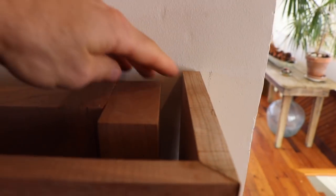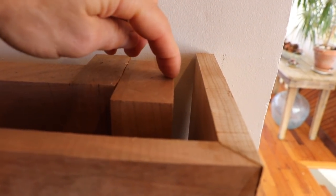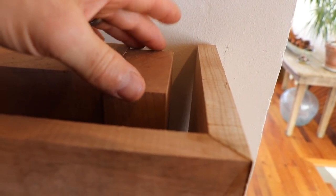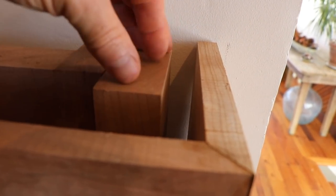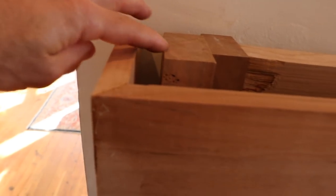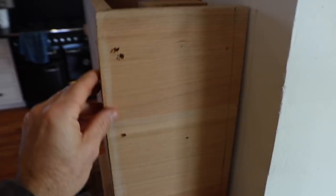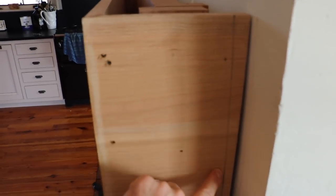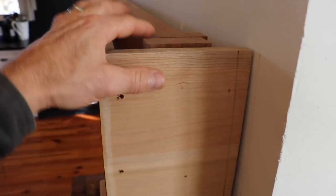All right, I've got my line scribed, and now I can show you if this was actually a 2-inch board, it would be flush on there, but I've got this gap, and it actually measures an inch, so I'm going to get a piece of scrap that I can screw on there so that I can then screw this to that. So I need one there, and I need one there. This is now a big, chunky piece that I can't exactly use on the bandsaw. So I am going to cut that off with a jigsaw and make these scraps, and I'll be right back.